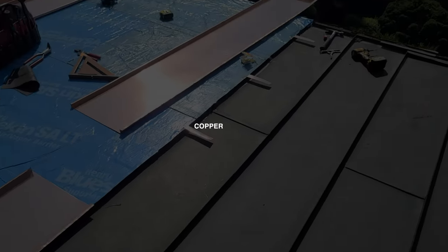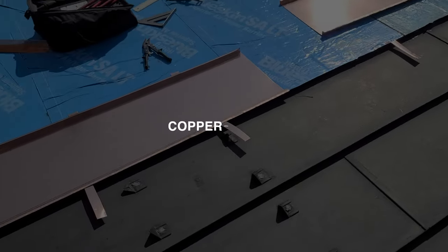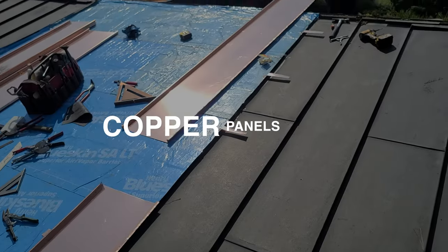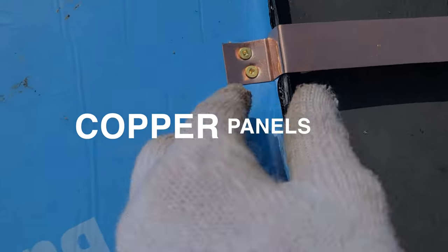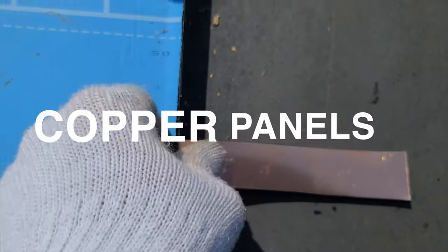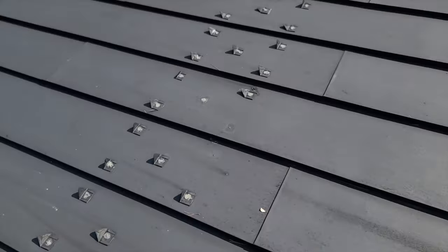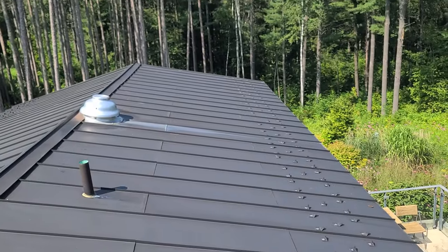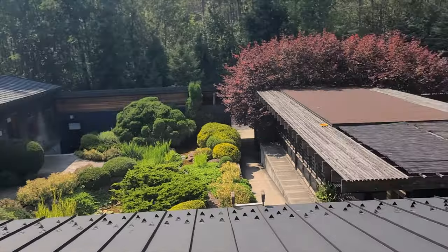What you have to do to clip down a single standing seam — much like what you see right there — is install clips with long tails. Those are just clipped in right now and the panel will sit, these will bend down and then bend back over the top to hold the panel. Because they didn't use high-temp ice and water, all these panels are adhered to the roof — they're all stuck to the roof, which is probably why this roof has never flown off.